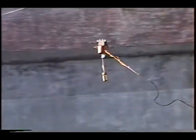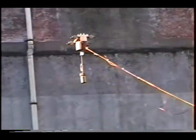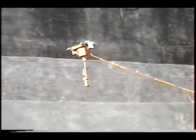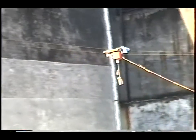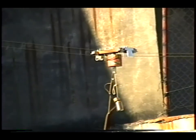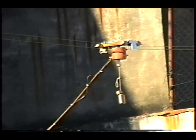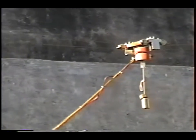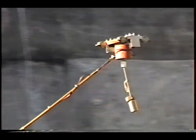By this time the collector was very improved. The contact with the wires was made through carbon inserts fixed between the pulleys on each side. Other improvements included a rotating apparatus in the lower part to prevent the cable from being twisted when the trolley car negotiates the turns.